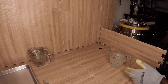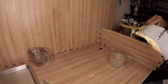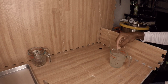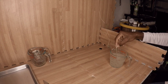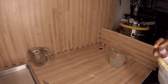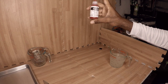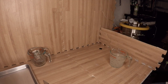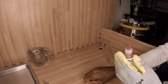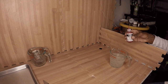All right, guys, so I have just finished cooking up my first cup of plastic, and we're a little bit under 350 now. I was at 350, but let it cool down a little bit. And to this cup we are going to be adding MF Maroon Red Shad non-bleed. The reason that I'm using a non-bleed version is because I don't want the red to bleed into the blue once we put it into the package.